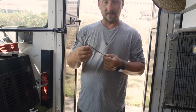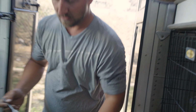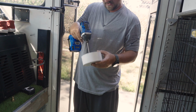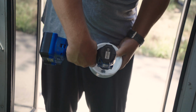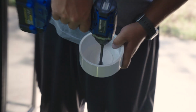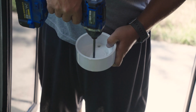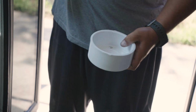All right, so now got the 3/4 inch paddle bit. This one matches up to the 1/2 inch end of this coming in. This might get a little sketchy because I'm holding the cap while doing it, so it's, again, side of the road build. You're gonna take your point and put it right in there into your pilot hole, and just slowly start easing into it without stabbing yourself. And there's your hole for that.